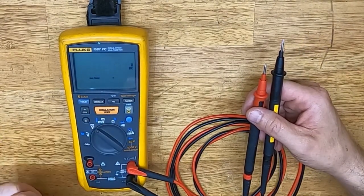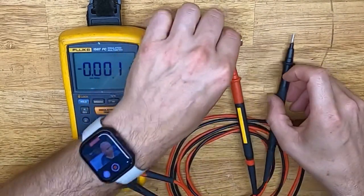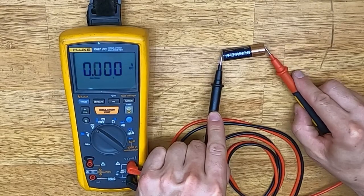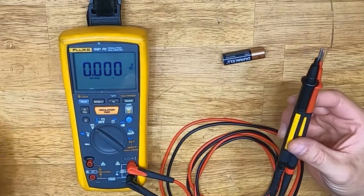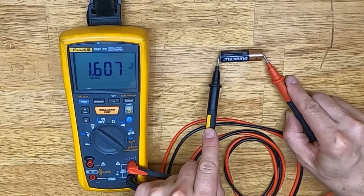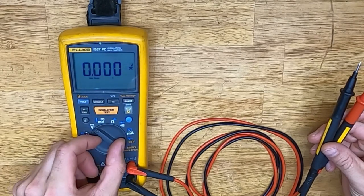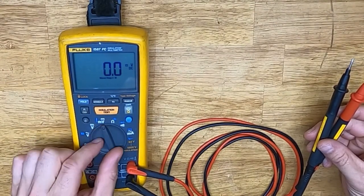The next one will be DC. Generally that will not pick up any ambient voltage. And if we want to test a battery, we can come right over here - typically the red will test the positive side, the black the negative side. 1.6 volts. It's much better and more accurate than your typical battery tester with a little meter on it that shows you a battery is good or it's not. You can see right here that at 1.6 volts, that's about as good of a charge as you'll ever get on a double A. When they start to go bad, they get down to about 1.3 volts and that's when they won't function. So it's super easy to use. If you're trying to measure something under a volt, the millivolts setting is what you would use.